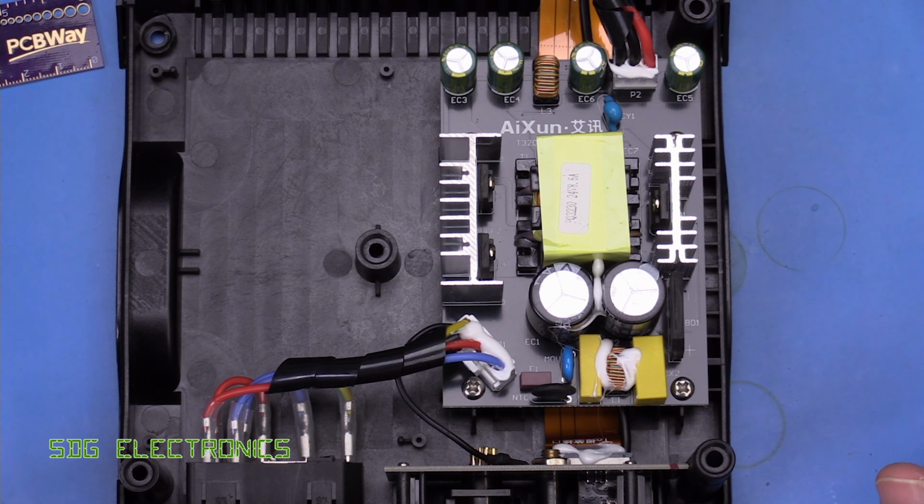We've got one wire which is the earth going off to the banana jack on the back, but it also returns along here. Now you'll notice this wire is extremely thick, but it's actually almost all insulation. It's super flexible, and that's because it runs underneath the power supply, so they've enhanced the insulation on this one wire. And they've also used a flat flex cable to connect this back panel PCB, which I can't actually remove because some stuff's glued in place.